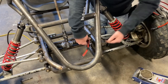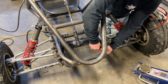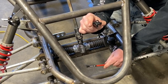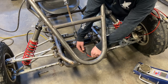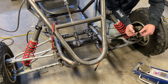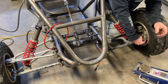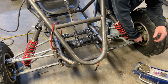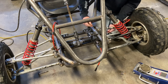All right, first on my list is this short connector. Just screw that right in. And then from this short guy, there's gonna be a T connector specific to these ends. And that's gonna sit right in the middle. All right, so the bolts for the front brakes, washer, banjo, washer. Just screw it right in. And then we'll have to figure out how we want to route it.